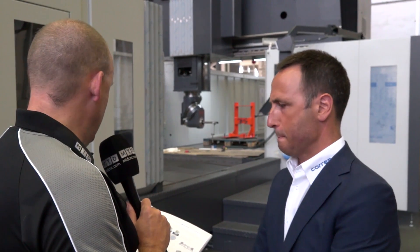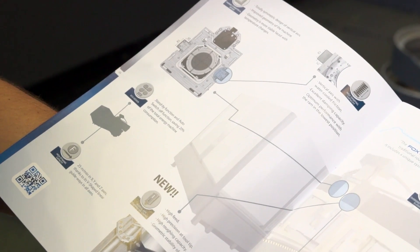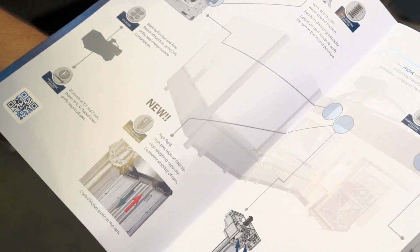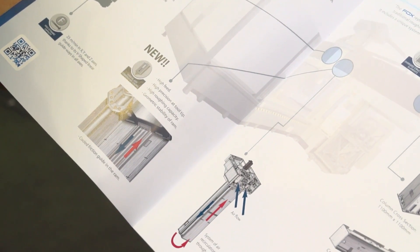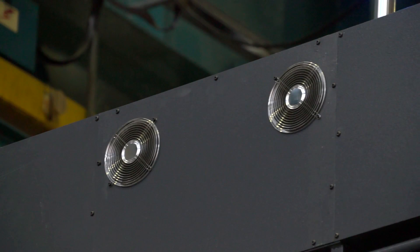Talking about that RAM and it being box guideway — that's water cooled as well, is that correct? Yes, it's fully symmetric, so it's easier to control the temperature. It's cooled by water and also air. We use a water cooling system and also a chimney system with some fans. So we have the same temperature outside on the workshop and inside in the RAM.